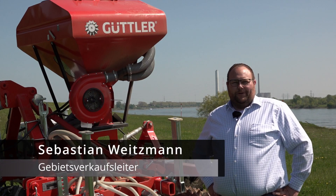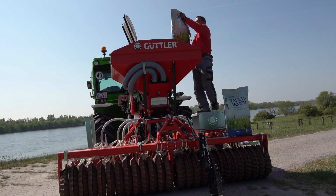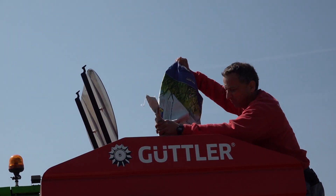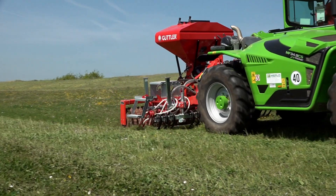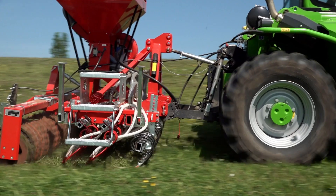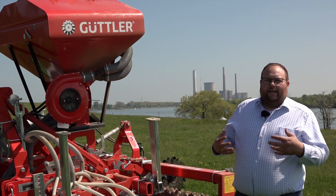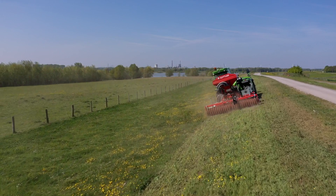As we just heard from Mr. Opriel, we are today at the Lower Rhine, at the new dike in the Wesel district. We are here on a field trial where we want to carry out dike maintenance and dike renovation with the tine harrow. We go in with our harrow at a slightly sharper setting, loosen the soil, tear out the weeds, and create — using the 12 mm tines in combination with the ripperboard — a fine, crumbly seedbed in which we can lay our seed beautifully through the tubes, close to the ground, which is especially important. Particularly now in today's conditions, where it is getting drier again, I have the seedling at the ground, press it with the prism roller, it has soil contact, can germinate, and is embedded in moisture — achieving optimal emergence results.